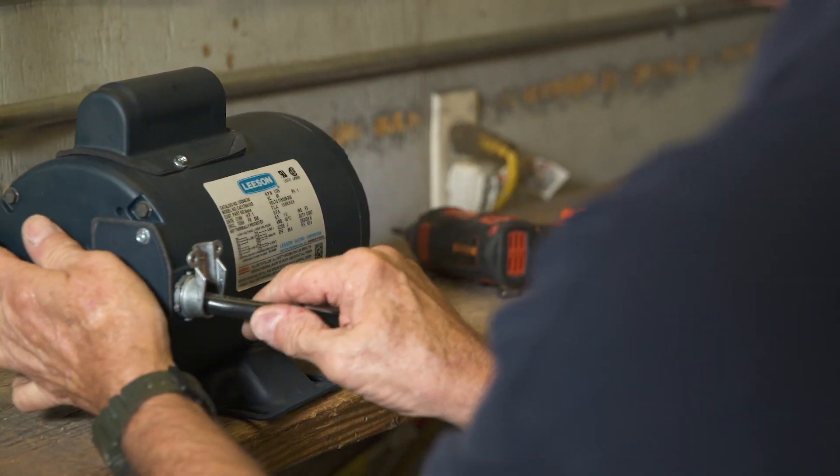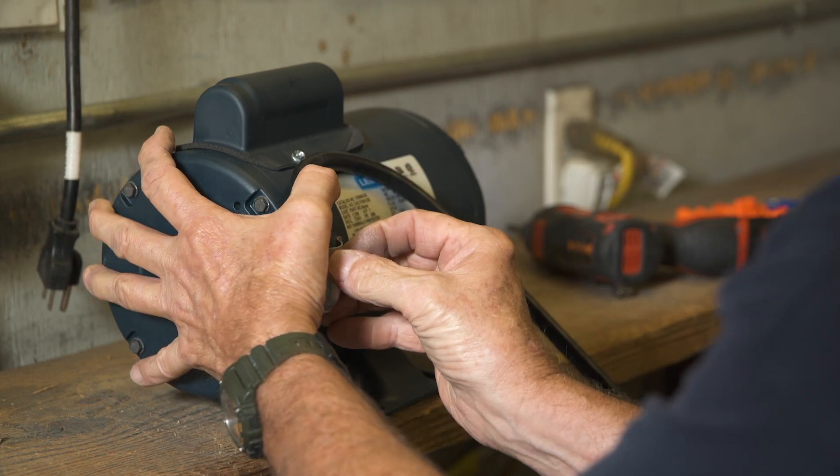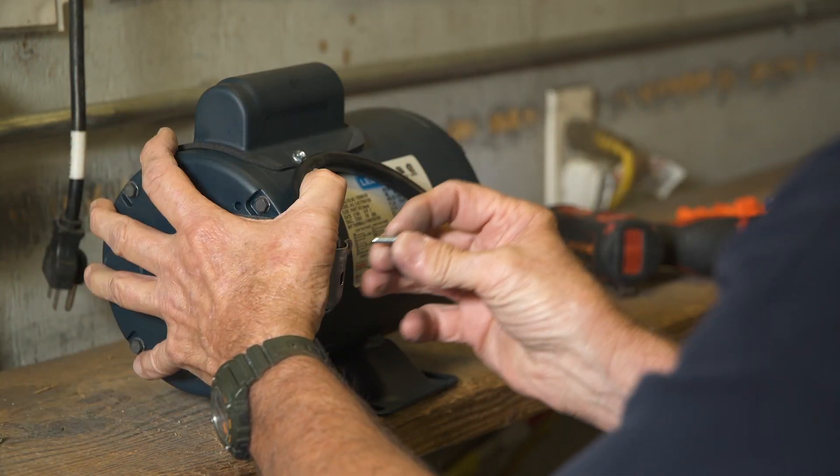Bend the switch wire harness over the metal elbow, making sure no color wires are showing, and place the cover back on the elbow. Tighten the screws.